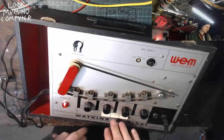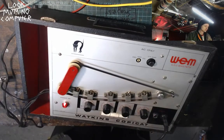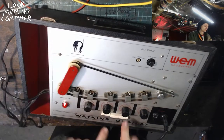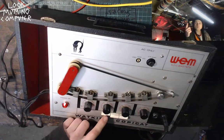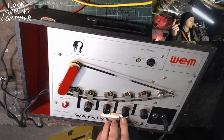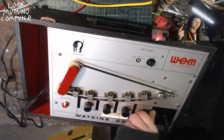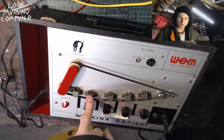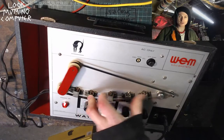So it's like a normal tape echo, and it's got three different playback heads. Head 1, head 2. Mix them all together. But yeah, you get some pretty funky rhythms from playing around with these different tape heads, which are a different distance away from this one, which is the recording head. So they play at different times away from this one.